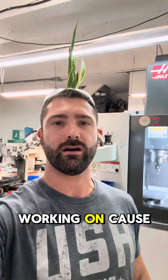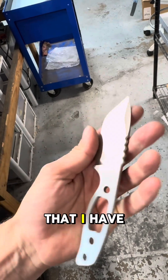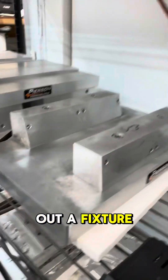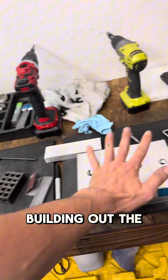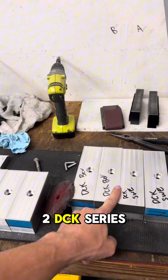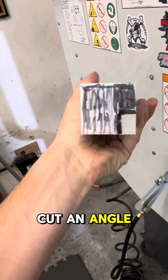This is a weekly update to show you what I'm working on, because I'm not going to have a drop this week. These smooth bevels I have on this Vendetta — and on all those new blades — I have to build out a fixture like this one, which will hold the blade at the angle to cut this out. Building out the fixturing in order to make the gen 2 DCK series Henchmen and Daggers.